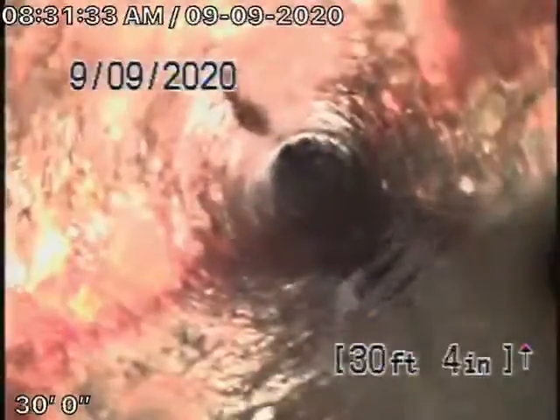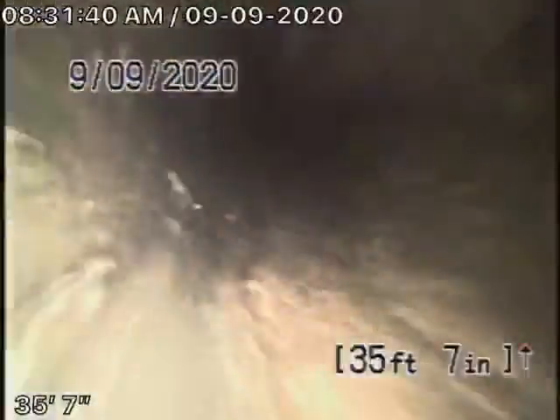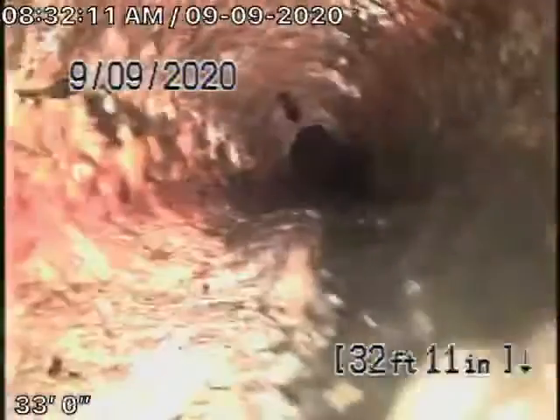We just want to give you an idea of what the cast iron looks like — a hell of a lot different to what ABS plastic looks like. And does it look like it's getting narrower? Yes. You'll be able to tell the difference. There's ABS. It takes a 90-degree turn down, then goes into ABS horizontally. You can tell the difference between ABS and cast iron. The cast iron is going to wear away much quicker. The key is to not flush what I told you. If you ever want to clean this line, only a cable with a blade. No hydrojetter through this line — you'll break it.